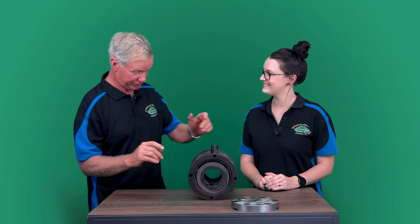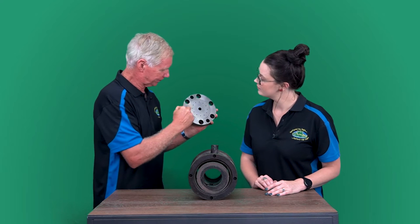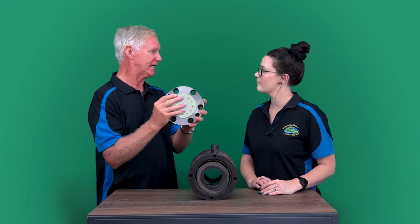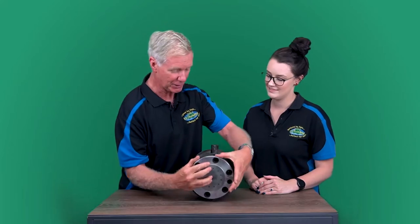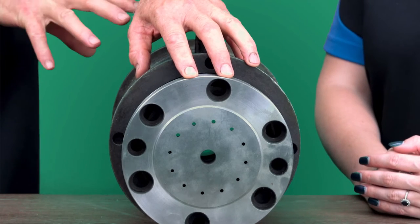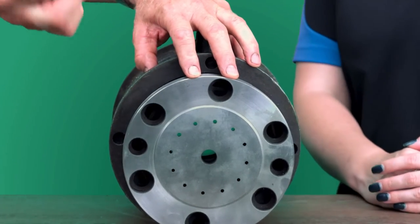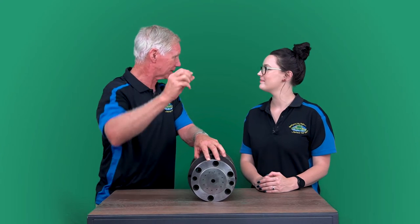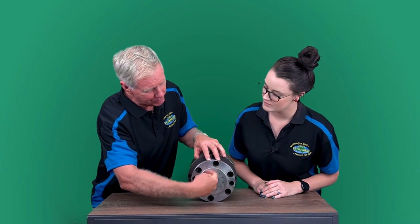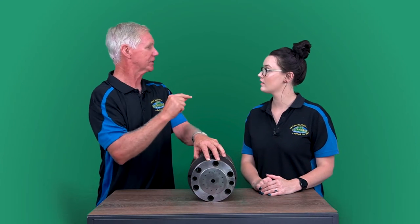How do we get a pellet? Well, in actual fact it's very simple. If we take the die plate, which is just a walloping great piece of metal with a whole series of holes in it — these are bolt holes out here, that's where it bolts onto the front of the machine. As this machine cooks the material and pushes it forward, it gets forced out these little holes like a string of spaghetti — it flies across the room if you don't do anything with it. What we have then is a cutter head, a knife that is spinning really, really rapidly, that simply chops those strings of spaghetti into little bits. There's your pellet.